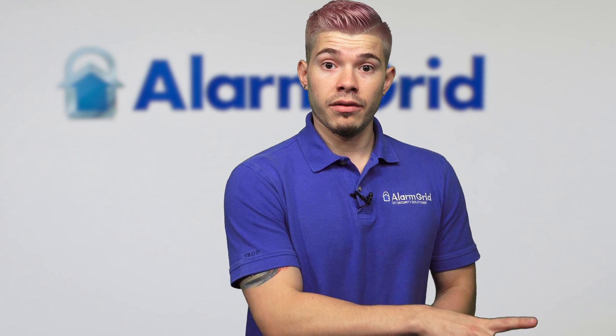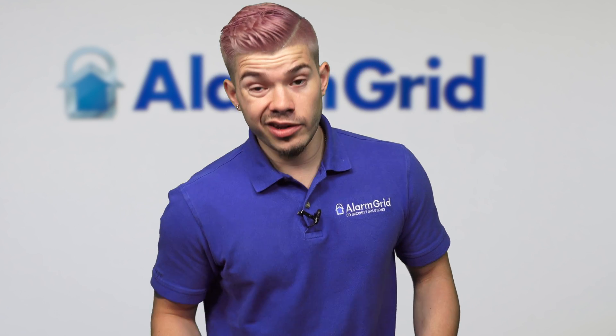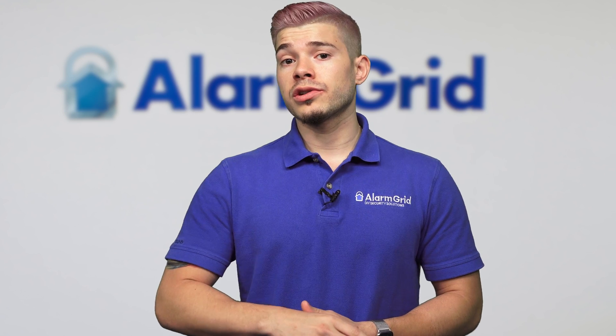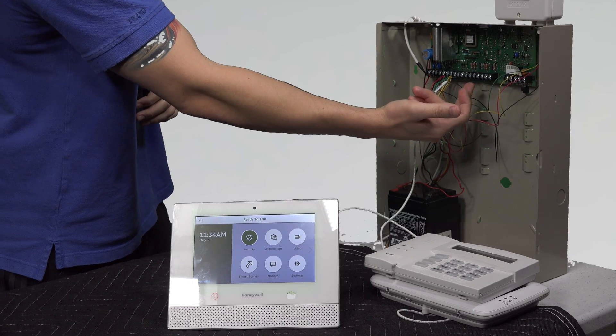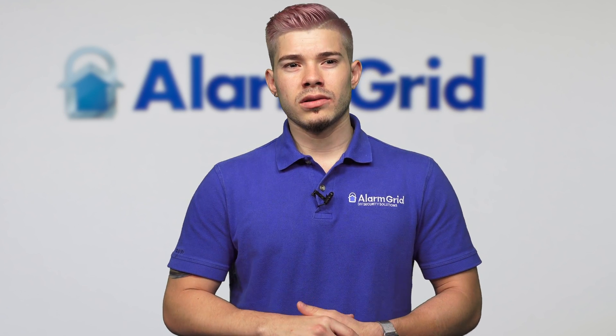The Lyric is all of that but in one encasing. This is the Lyric panel here — Honeywell's latest wireless all-in-one system. The Lyric panel holds 128 zones. The Vista panel holds a total of 48 zones — eight of them are hardwired zones on the motherboard, and then you have the option of adding zone expanders, each holding up to eight zones, so you can add all the way up to 48 with about four or five zone expanders.